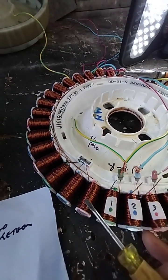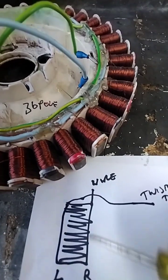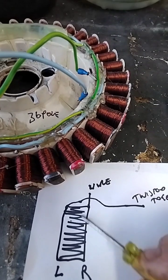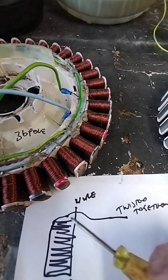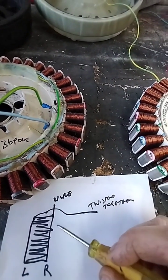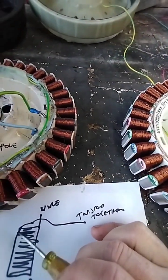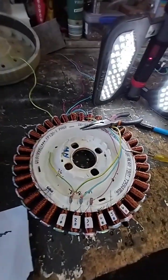If you have a look at each of these stators — each of these windings — you'll notice they have a left side and a right side. Diagrammatically, the winding has a wire on the left-hand side that gets wound round and round and comes out the right-hand side, or vice versa. Each right-hand side will go to a different wire depending on its colour coding. The left-hand sides will all get joined together in groups of three, because dividing it into threes will give us 12 volts.